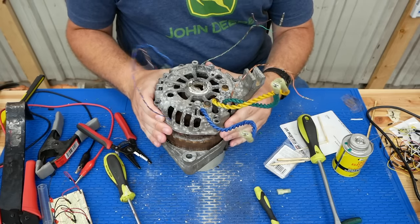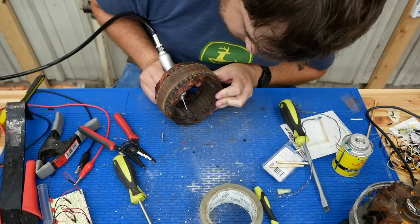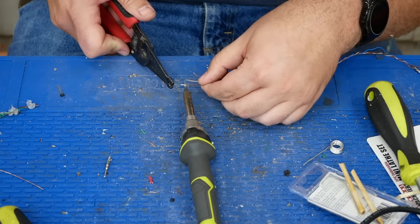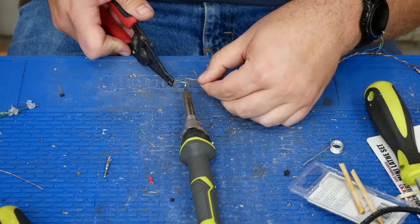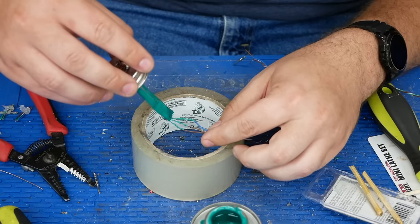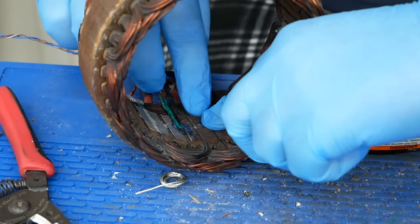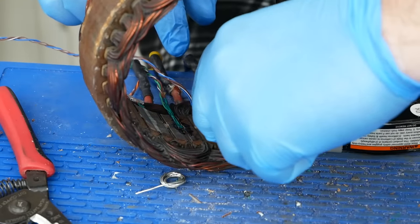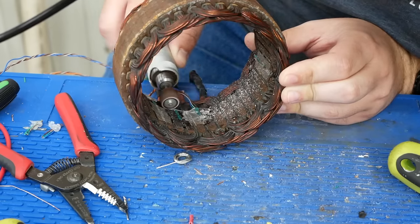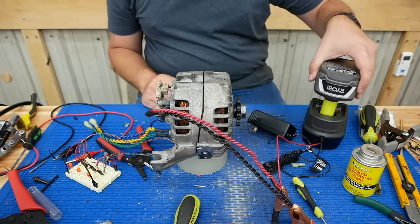Plugging six into the equation gives 20 — that's the number of mechanical degrees of rotation per 120 degrees of electrical rotation. Since my stator has slots every 10 degrees, I need to put a Hall sensor every other slot, which is far from every 12 slots as I had them. So I need to reposition two of my Hall sensors. This is the fourth time I've epoxied Hall sensors into this stator — I screwed up twice before. The Hall sensors are slightly too wide to fit into the stator slots, so I ground the slots open a bit, gouged out the excess epoxy, soldered thin extension wires pulled from an ethernet cable onto the Hall sensors, insulated the connections with liquid electrical tape, and permanently anchored the sensors with epoxy. Because of the claw shape of the rotor, the Hall sensors have to be in the middle of the stator.